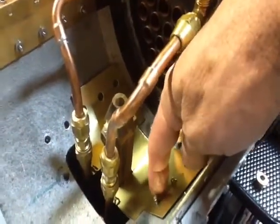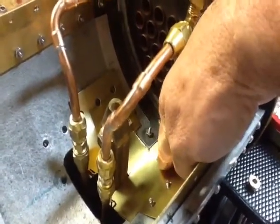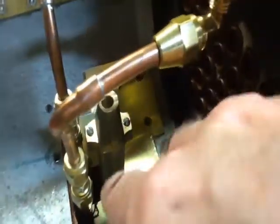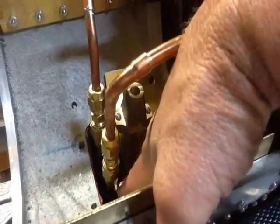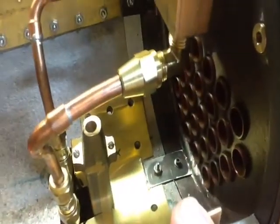These are 1/4 inch holes, and then number 10 are 3/16 inch bolts, so there's a little clearance there, which is good considering the bending and the arcing and all that stuff. But pretty happy with the way the back part fits. I will need to relieve this a little bit because I don't want that to be cutting into the steam tube to the cylinders there. But other than that, it's a nice tight fit.